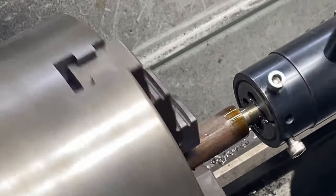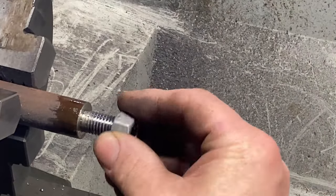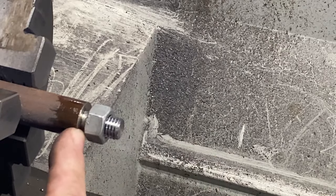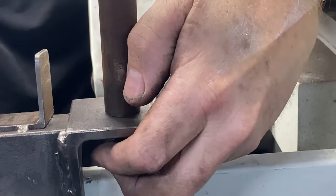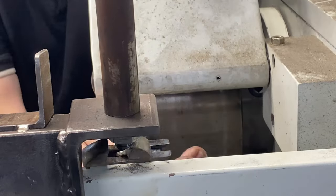The next step is to cut an M12 thread into the end. I test the nut on the thread and that works great — the gap there is less than the five millimeters that this thread sticks through the bracket. I fit the bar through the bracket, screw on the nut, and lock that nut down.